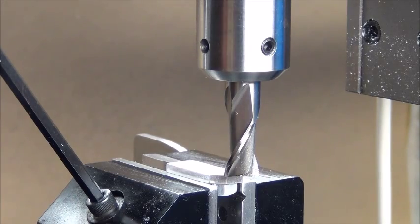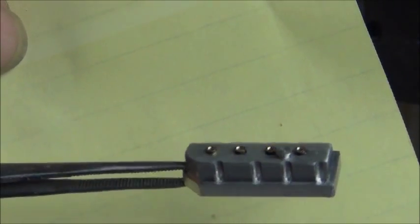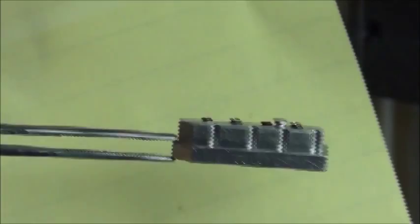Let me show the part here. I went across the top where I put those pieces in — as you can see them in the holes. I just put the parts in the vise, both of them, and took the end mill and went across in one whack and made them all the same height. That turned out to be a whole lot simpler than trying to cut each piece exactly the same, because they're just too tiny and it was too much trouble on the lathe.